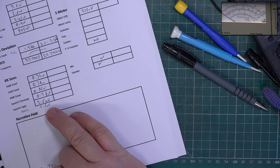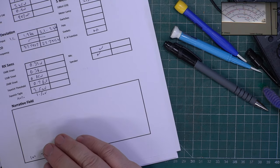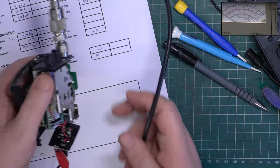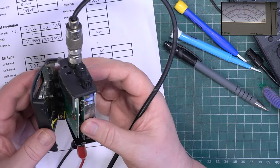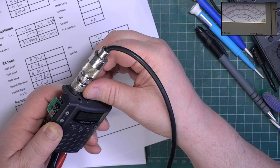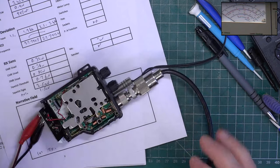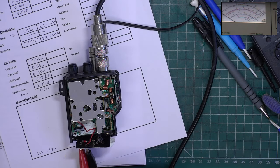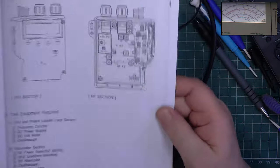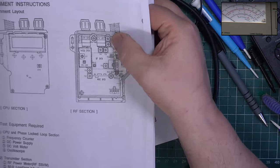Auto squelch was exactly where we wanted it to be and now it isn't because I've messed up the control - because the manual was wrong. The buttons have fallen out - oh no, they haven't, they're here. Go to the test equipment. I'll tell you what, the customer's going to be astonished at how well this works when they get it back, bringing that deviation up from 1.7. So let's see what the service manual says we have to do for receiver alignment - steps 1, 2, 4, and 5. Step 5 is the detector/IF coil. Step 3 you don't touch.